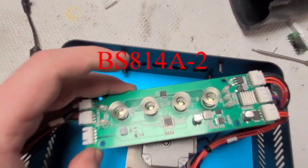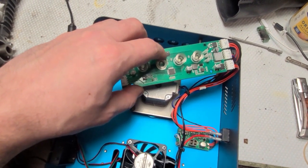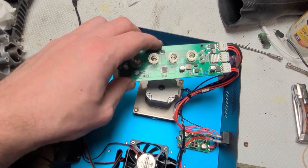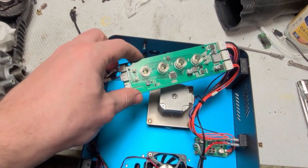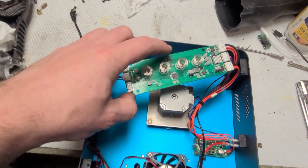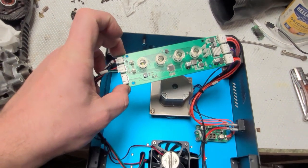I'll add a text to this video. In principle, this chip was the faulty one. I found it on AliExpress for about one euro and decided to just give it a try. There were no shorts, it wasn't blown or anything — it just gave up. Resoldering this chip was the solution.